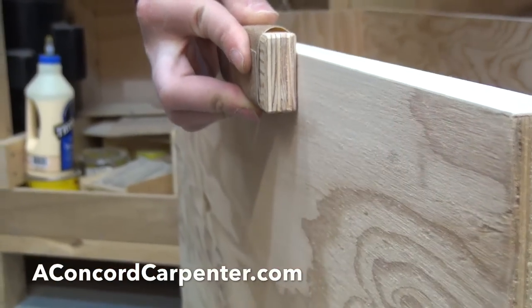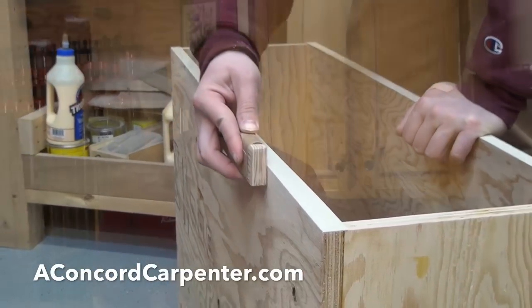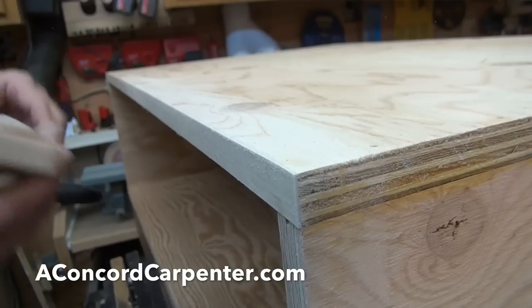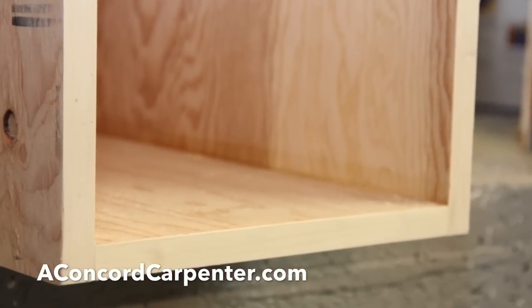Follow the same trimming process with a utility knife. After trimming, either use a cabinet scraper to trim the excess or sand it flush with 150-grit sandpaper on a block, sanding gently. Then cant the sandpaper and make a couple of quick passes over the edge to smooth it and create a nice transition. In a nutshell, we're trying to make plywood edging look like solid wood from a distance. If done properly it's going to look great. I'm Rob Robillard — we'll see you next time in the shop.